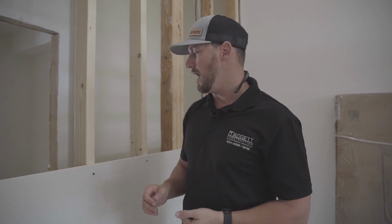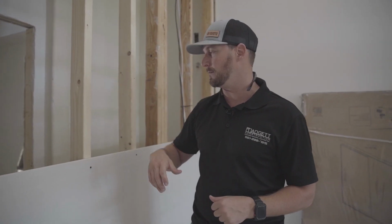We just went with the 1 5/8 studs for our build. They're definitely a lot less weight, and for us it was just cheaper and faster. We're really quick with just snips, snapping them and getting them installed a little bit quicker. And we weren't too concerned with the structural integrity of not having a wood frame in there because we didn't cut out that much of our container.